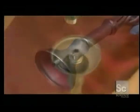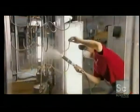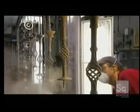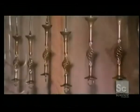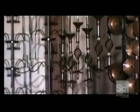A worker attaches decorative components — including a loop to hang the chandelier and an end cap that attaches to the distributor — completing what is called the center core by tightening everything in place. They then spray the upper and lower arms, as well as the center cores, with powder coating, a finely ground plastic about the consistency of talcum powder. The parts then go into an oven where heat cures and binds the coating, giving them a hard finish.